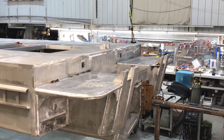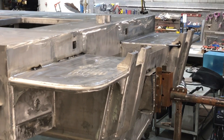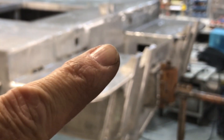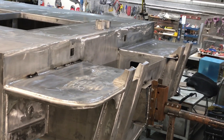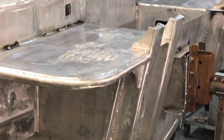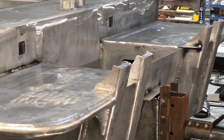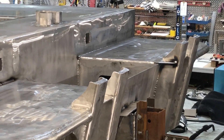Now I have the engine mount brackets on. The only thing left to do is the little piece in the center for the inspection hatch. I've added five by five three-eighths rounded corner box tubing, two for each engine.